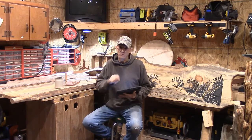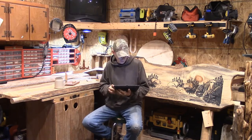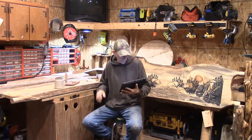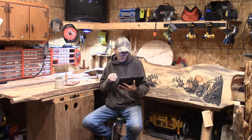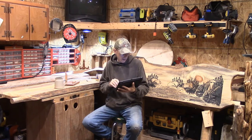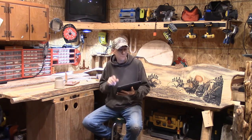Ball nose — if you do any 3D engraving, you have ball nose end mills. Ball nose bits offer great detail and smooth contours while removing maximum material. For intricate carving, you would try a tapered ball nose for the best surface finish and minimal tooling marks.